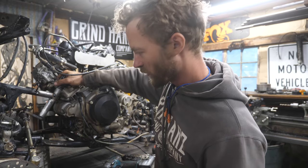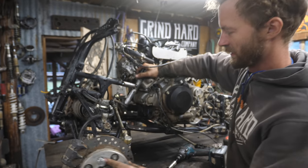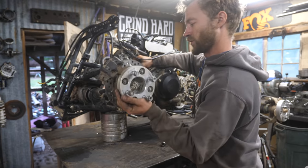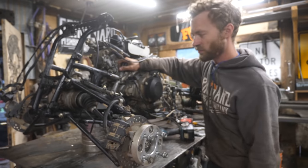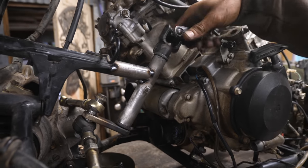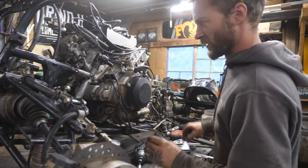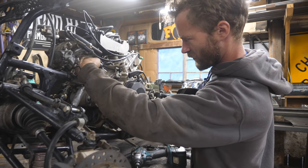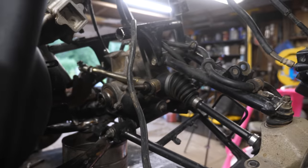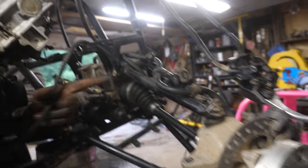It's been most of the day but we have about half of a steering system going on. I'm messing around with positioning to get the least amount of bump steer — with this much travel it's kind of difficult to get zero bump steer but we can minimize it. I shortened this pivot a little bit; the splines I cut with the grinder worked out perfect. There'll be a bolt that goes through to pull it nice and snug and give it a little extra strength. It goes over to the other side and there'll be an idler arm just like this so that side tracks exactly the same steering path.